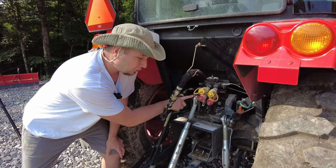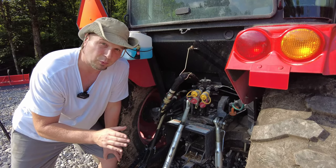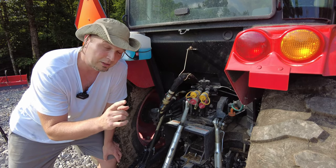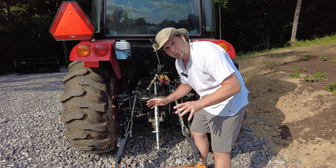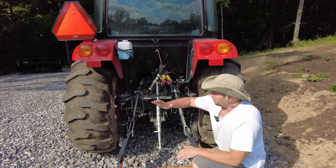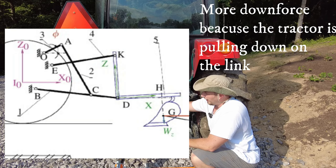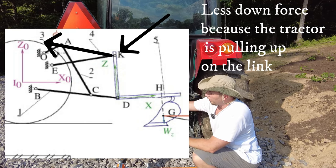When you have this adjusted in your top hole, that top hole is the least aggressive of your attachment points. You have to look at this as a pivot point. This top link doesn't move up and down — it stays in one position. The only thing that does move is the bottom links. So as this is in the bottom hole, that's the perfect position for a box blade. If you imagine the box blade wanting to come down on the surface, you get more tilt because your attachment point is lower in the back. Versus if your attachment point was higher, you'd have a more gradual down.